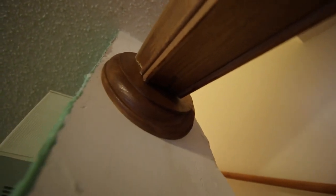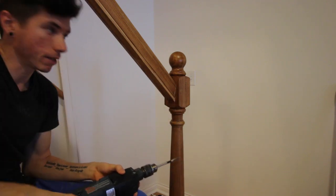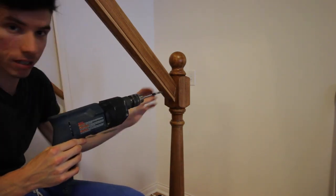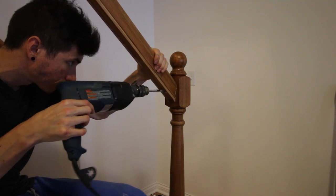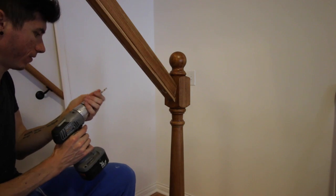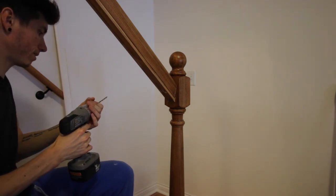Watching Bob Vila today, I learned a pretty cool way to get the handrail in place and figure out exactly where it needs to go — just use little finishing nails to hold it in place, and you can basically confirm it's at the exact right distance. Now that I'm happy with where it's going to be on the newel and on the top plate, I'm just going to drill a countersink hole so I can set the screw in there nicely. Good thing I watched those videos on guys building stairs, because that's a whole lot easier than how I was probably going to do it.